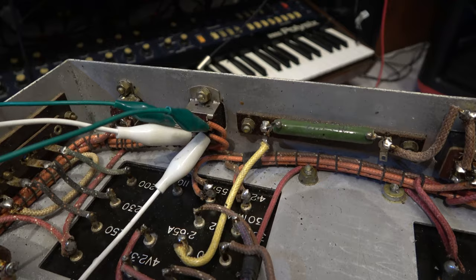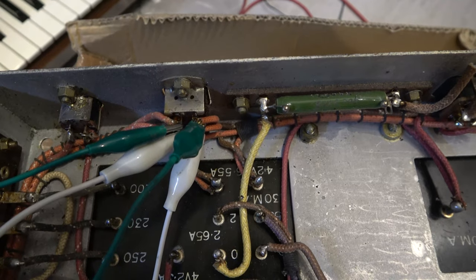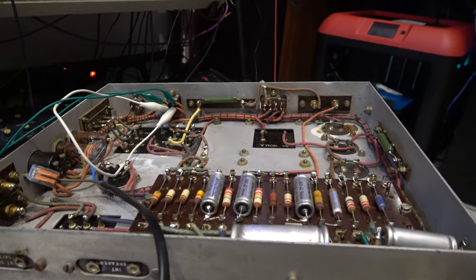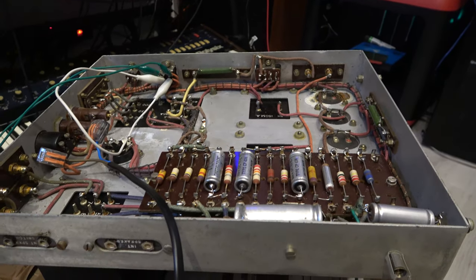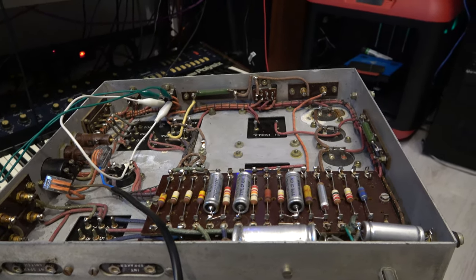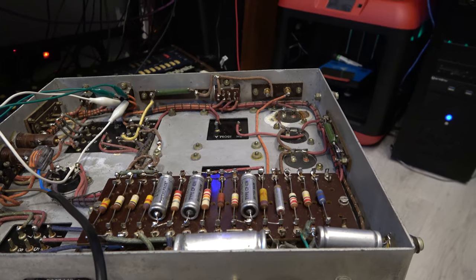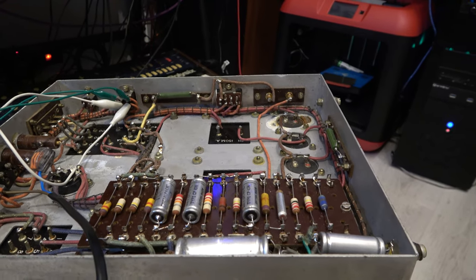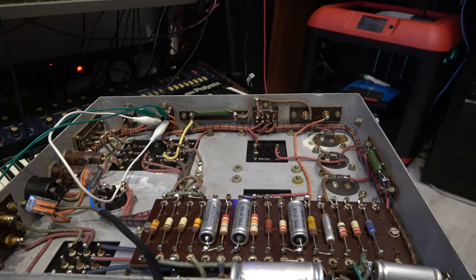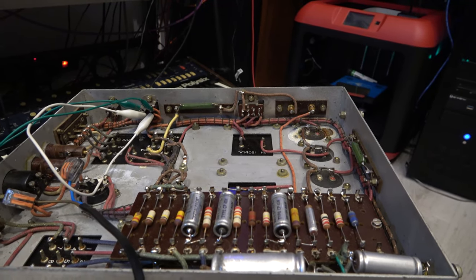I've also noticed that these wires here need to be jumpered and they are on my other amp - it's kind of like an external power port, probably for the radio. So they're jumpered on the other one so I've just temporarily jumpered them here. I've done the cap reforming as best I can, replaced the DC coupling capacitors with stuffed ones, checked the wiring on the amp, had a look at the circuit diagram and did the jumper there. I've got my inline bulb. So I think I'll just give it a go and see what happens - there's going to be a point when you have to do this and I think this is it now.